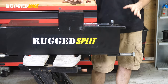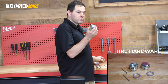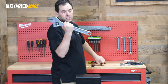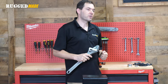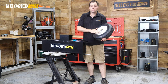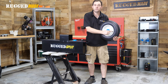Let's get the wheels mounted on the axles on the hydraulic tank. The hardware we're going to use is the castellated nut, the dust cap, the thrust washer, and the cotter pin. Tools will include a large wrench, a pair of pliers for the cotter pin, and a mallet and a wood block for tapping the dust cap onto the hubs. Take the dust caps off, but make sure that the bearing stays inside. The inside has the seal, and that's what's going to go up against the inside of the tank. You can also tell the inside and the outside by seeing which side has the valve stem.